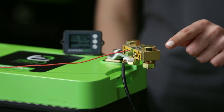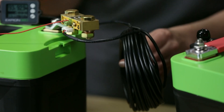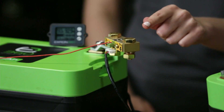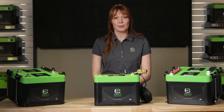For an accurate reading, make sure that all negative leads are connected to the P-minus side of the shunt. The installation kit includes a 35-foot data cable to connect the shunt to the display screen. The display screen is the user interface, and a shunt is used to measure power in and out of the battery bank, along with an aluminum adapter bracket to install the shunt on the battery bank.